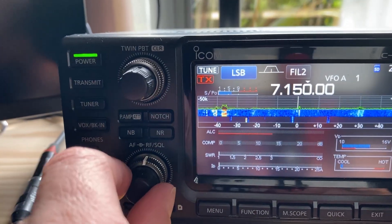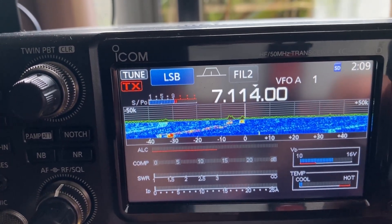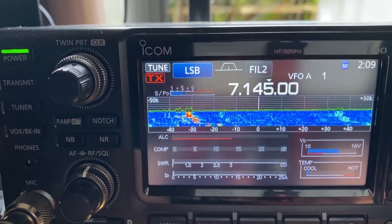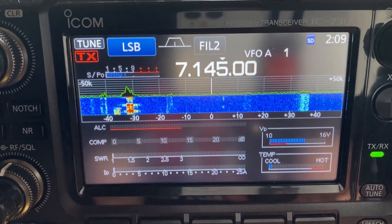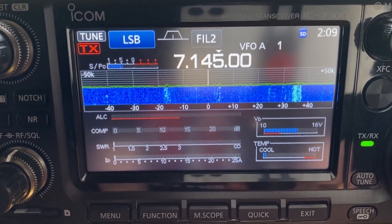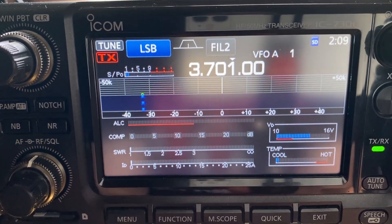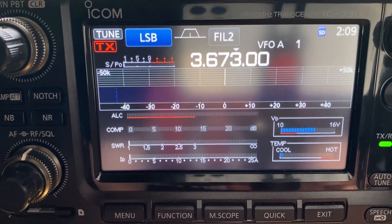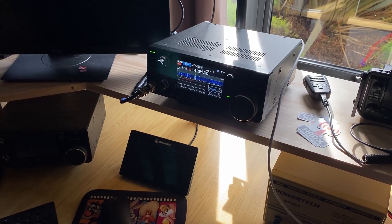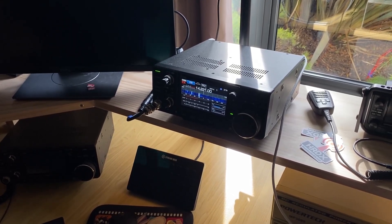30 meters is pretty quiet. 40 meters is a little bit noisy — it's about an S5 to S6 noise level, and you can see there are a couple of strong stations. There's a local so he's 20 over, but yeah, 40 meters is not too bad. At my old place 40 meters had lots of birdies, so at least they're gone. Whilst the noise level is up, at least I don't have to deal with them. And then of course 80 meters — the element is sitting on the ground so I can't give you a decent test, but I have had 80 meters strung up temporarily and the noise levels are not too bad, fairly similar to 40, and I can hear stations on it. Thanks for watching — I'll put links to other DX Commander videos. 73.